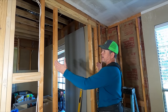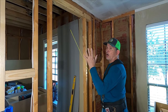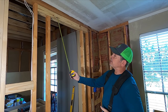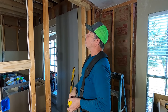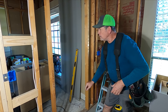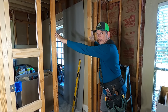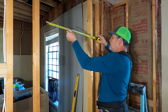This is going super quick. Got our new studs in — I'm just kind of using what I had out back. This is a load-bearing wall but all it's holding up is this little bitty ceiling, so I didn't have to worry about supporting it. I had a four-by-four out there so we used some six-inch structural screws to fasten it together, and now our new studs are under that four-by-four. We're going to put a horizontal piece here with a stud in the middle, a horizontal piece here, and the space between those two horizontal pieces and these two studs will be where our future niche is going to be.